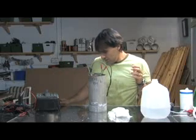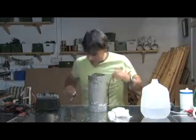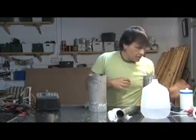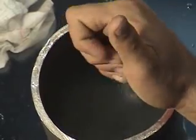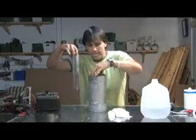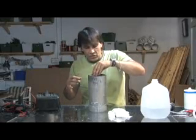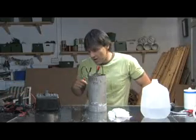I'm going to fill it right to the edge and we're starting to get some very fine bubbles, nothing too exciting though. Now I'm going to pull this out and add a little bit of salt. What the salt does is make it more conductive, so you'll see the amps it pulls going up quite a bit. I'll add just a touch — about a tablespoon — then mix it around. The neutral plate increases the surface area and makes it work a lot more efficiently.